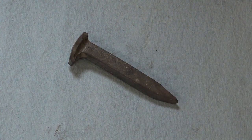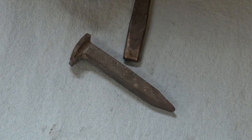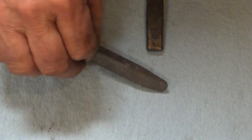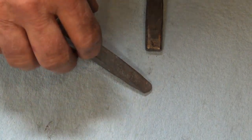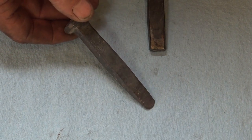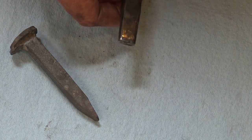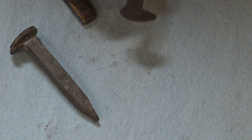The plan was to start with a railroad spike and turn it into a little tomahawk using the punch that we had made the other day. The punch had a pyramid shaped point, and this one is the same punch but it's been modified a little bit now. That pyramid point was just pushing through and then you turn it over and push through from the back — it was just pushing the same thin membrane back and forth. It never sheared any kind of slug out. So I modified the punch into a slot punch that fit right in where it had been pushing back and forth. That did punch an acceptable hole, but it made the eye quite thin in the process and made it kind of an ugly little eye.